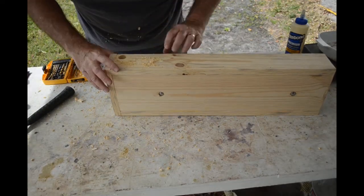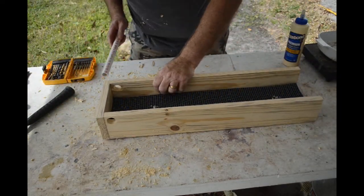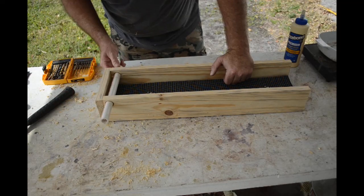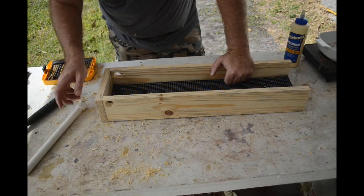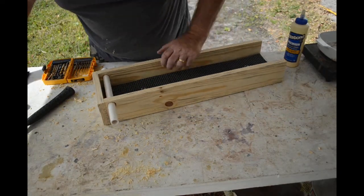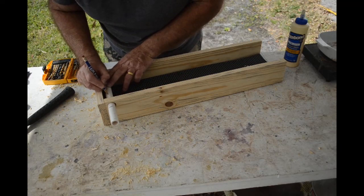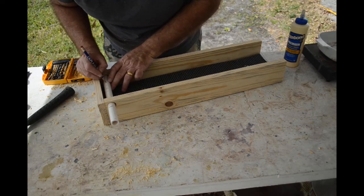Okay, that's done. Pull the debris out. Look at that. If you don't glue the fittings on both ends of the pipe, you can just take off one end and slide this out, take the back off it again, and use it in the running stream. So what I need to do is cut this to length, right about to here. And I need to drill a bunch of holes in it to let the water out to make a spray bar.